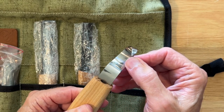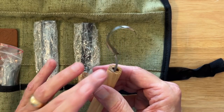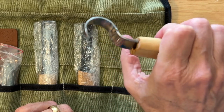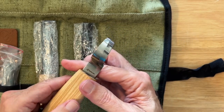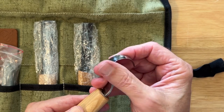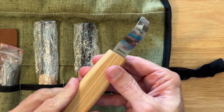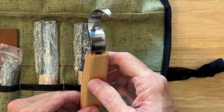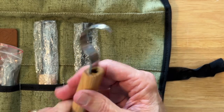This is a right-handed tool — it's important to be aware of that. If you're a left-handed carver like me, be aware that the kit includes a right-handed hook knife. I'm ambidextrous enough to use it since the motion is very simple. If you do want a left-handed hook knife, they sell those on their website. The edge on this is hollow ground, and the tool is mounted well into the handle. The handle looks like it might be ash or oak, hard to tell. Has a pretty good feel. This hook knife is high carbon steel.